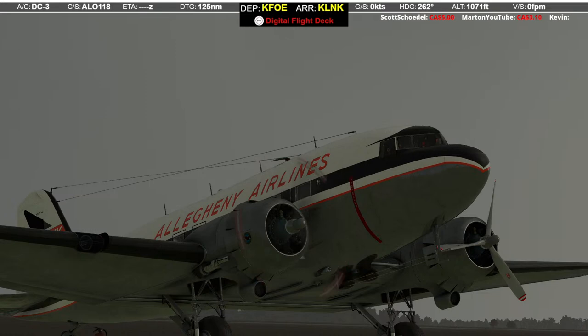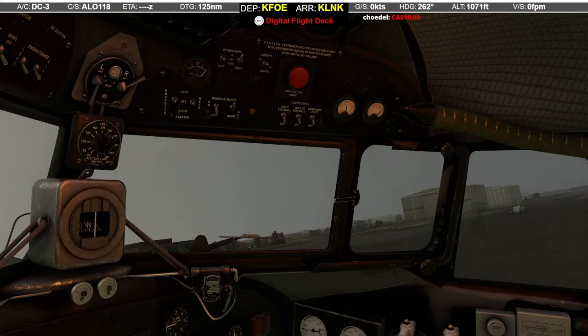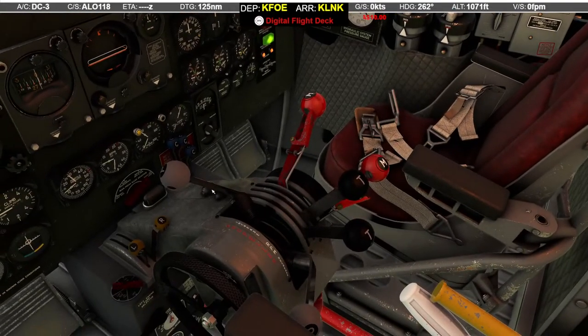It's going to take a second to fully get up to speed and going. These round engines, the cylinders can not all fire at the same time. On a 9-cylinder, you might get 6 or 7 going, and then as it starts to warm up for the first few seconds, the other ones will kick in and start going as well. You can actually hear the sound change as that happens. It's an interesting process.